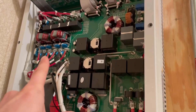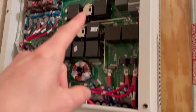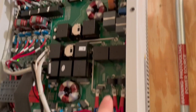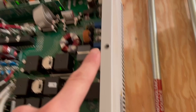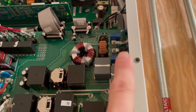You've got all of your solar inputs — those are the solar outputs going back to another board. These are all relays for grid connections and load output connections, to be able to control when it's connected to the grid, not connected to the grid, and feeding outputs. These are the inverter connections up here: inverter two, inverter one, and the neutral.